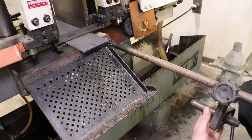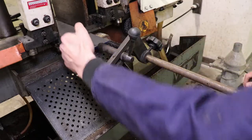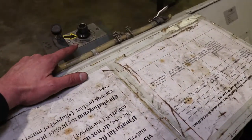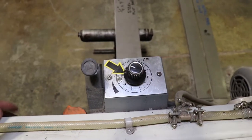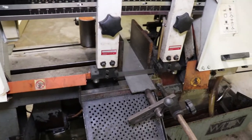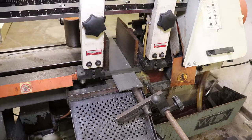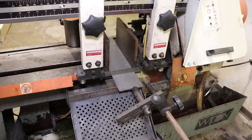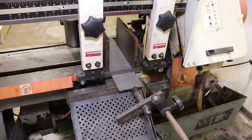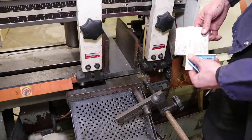And since you're making repeat cuts, this device, when set up to touch the material, can act as a repeat stop. We then set the speed control to the setting right at the arrow. You then complete your cut by hitting the on button. The coolant will flow and the saw will drop automatically. And there you have your four inch part.